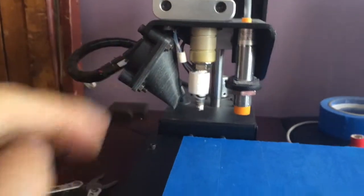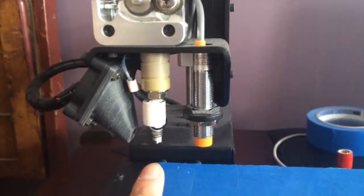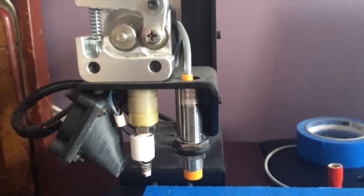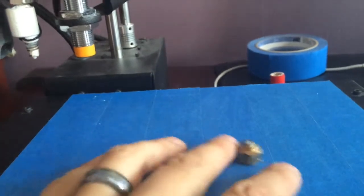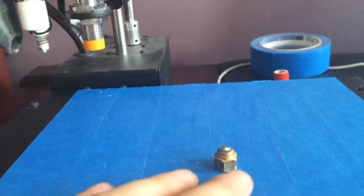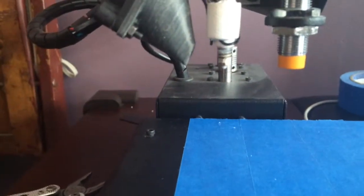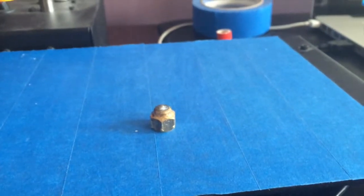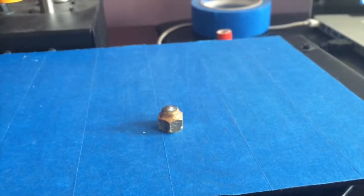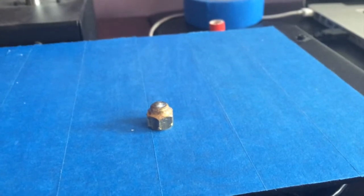Because this is a hot end printer, I have to bring it up to temperature, so that's 230 degrees Celsius, by the way, just to be able to get off the nozzle, which is extremely hot right now, so I don't really want to touch it. But I was able to push some filament through and it came right through, which means that the main problem is here on this nozzle. So I'm gonna dip that nozzle in some paint thinner for, I guess, about 6 hours while we go out and do some things. When I come back, I hope that it's clean.